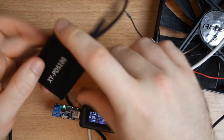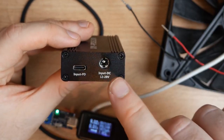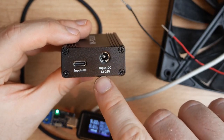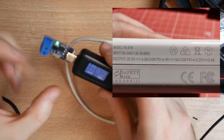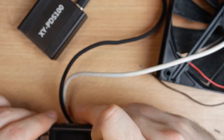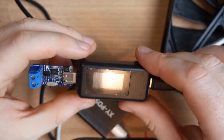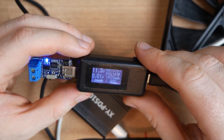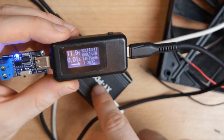I just want to quickly talk about this device — the XY-PDS100. It's not critical for this project other than for the test we're about to run, but it's a really useful device. It converts any power supply to a power delivery one, or even converts a power delivery supply to another power delivery source. For example, a Mac charger that only supports 20, 9, and 5 volts — you plug it into this and it will offer 20, 15, 12, 9, and 5 volts. It's really useful to have around, especially if you have a TS80P, since 12 volts is actually quite an uncommon power delivery supply level.